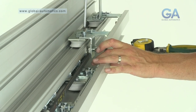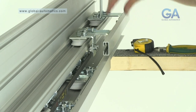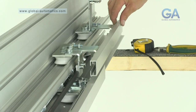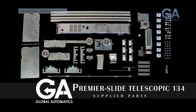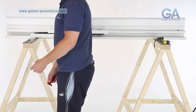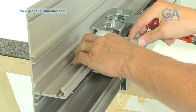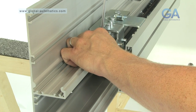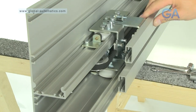4. Fix the connecting belt clamp to the rear master carriage assembly and tighten. Stage 7. Fitting the end stops. Select the two end stops. Slide the end stop into the second running rail. Ensure a 50mm overlap to the top rail. Repeat the insertion of the end stop for the other side.